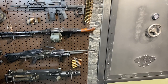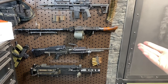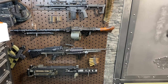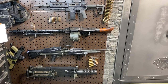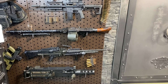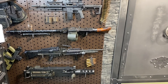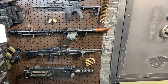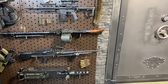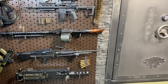At the time, the guns considered the machine guns of the day were all manually operated — not automatic. They all basically employed hand cranks and things of that nature to keep them going, and in many cases didn't have a very fast fire rate. So Maxim began experimenting and designing, and happened upon the belt feed system, which was kind of derived from some of the earlier chain-fed guns. This was an honestly pretty revolutionary new system. He further developed the operational mechanics so that the operation of the firearm itself extracted the old round and reloaded the new one, all without anything further than basically your thumb to depress the button. He took his initial prototype around Europe to different trials and basically decimated the competition who wasn't even in the same league.